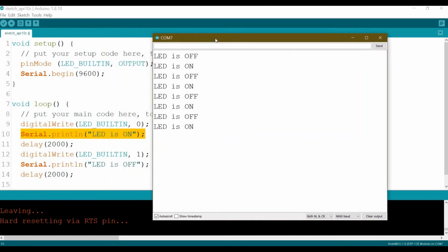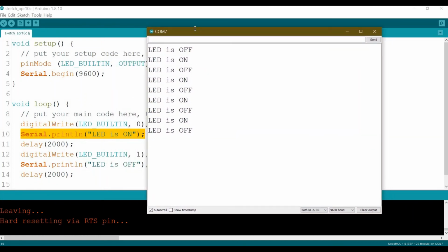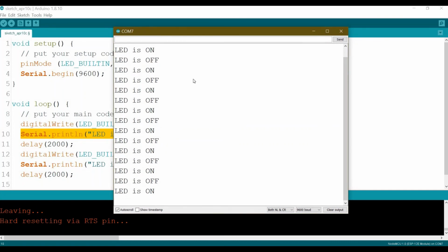But yeah, with this very simple basic tutorial, if you successfully did all this, you can make sure that the circuit is working and the ESP is successfully being programmed. But please take note of this: if you already upload any sketch to your ESP8266 and it's running, you will lose the AT command functionality. It means you cannot access the AT commands anymore.